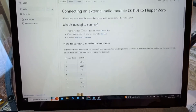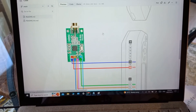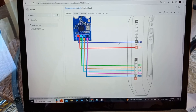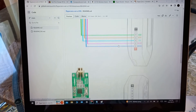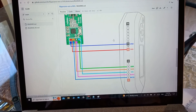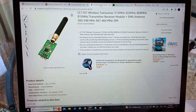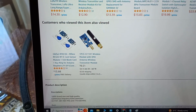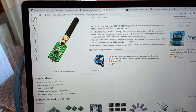Over on GitHub, there's the blue board that the EUR Design guys are using, and there's the one I got off Amazon — the green board. They are wired slightly differently, so you need to be observant of that. When I first wired mine based on the blue board pinout, it didn't work. After some research I found that the green board has a slightly different pinout. These things are just dirt cheap — about $10 with $5.50 shipping — but amazing what you can do with them.